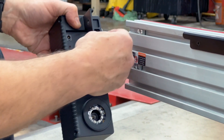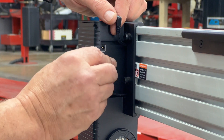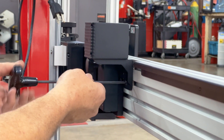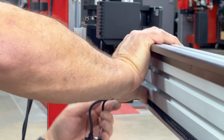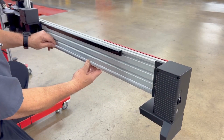On the other side of the crossbar, you'll take the two leads and then pass them through the right camera module bracket as you attach the camera and connections. Next, you'll attach the third camera to the center left of the frame as shown, and then route its power and communications in the lower back channel of the crossbar, making your connections and then install the channel guide in place to protect the cabling.